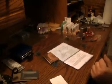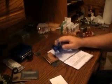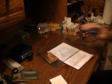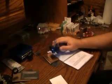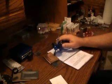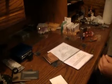We have, what, 17 more facets and 3 adjustments. Well, 2 more adjustments. I have to go to a 16, and then I have to do the table. And I'm going slow on this. I could put it in high gear and get a little bit of rougher diamond, but I don't want to do that. Looking back on this, I probably should have went to a rougher diamond. This particular facet or set of facets took way too long for me.